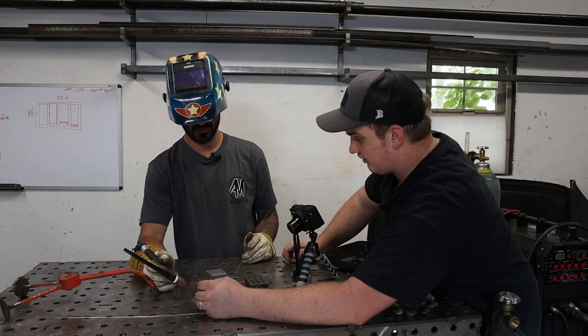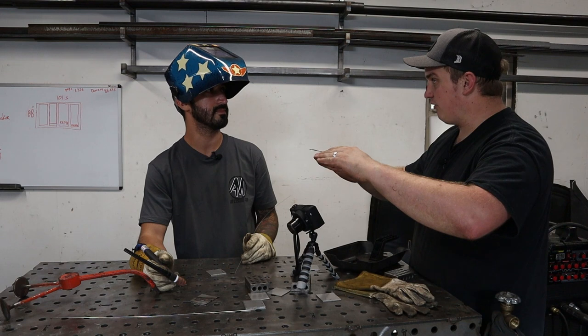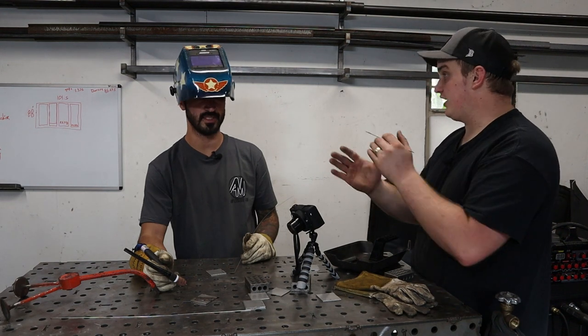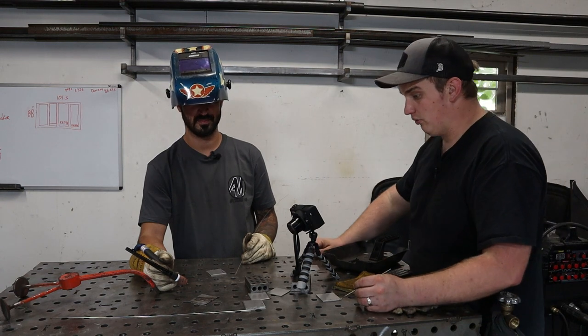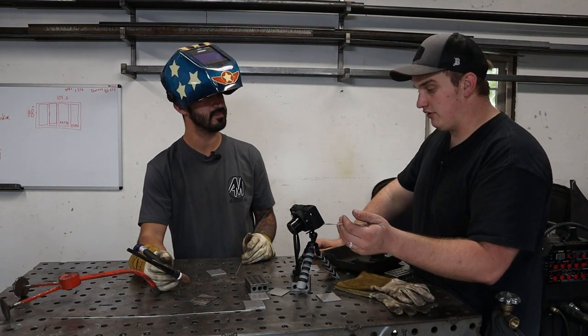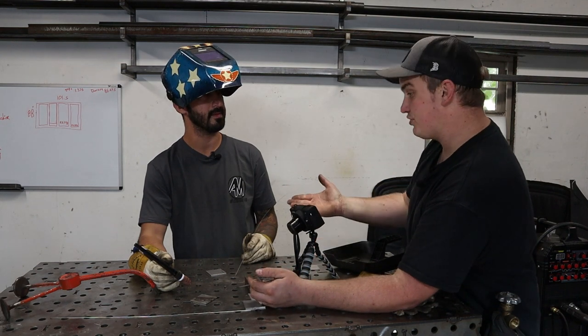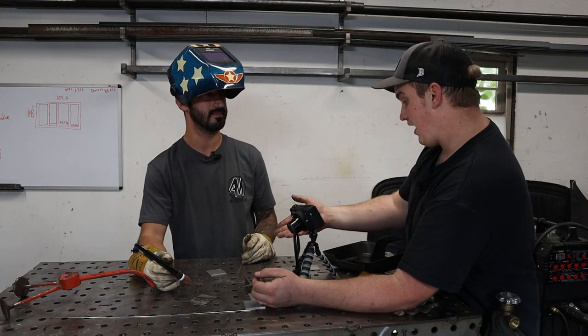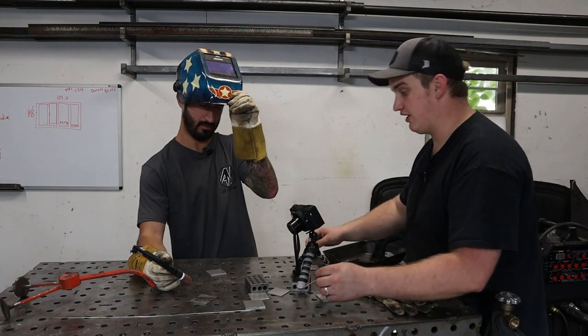And then I'm also looking at the width of it, so that when I put that dab in, it's filling out to the width of my previous bead so that I get as consistent a weld as possible all the way across. You can do that by your travel speed, those three things we talked about: travel speed, adding rod, or regulating the pedal, bringing those to that correct width.